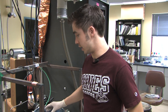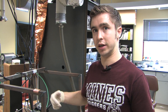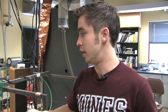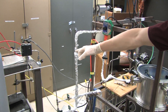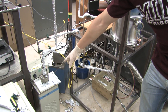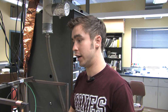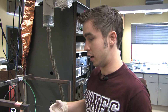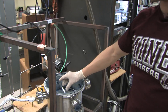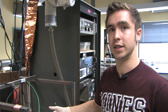To apply the second membrane on the outside — the one that attaches to the hydrogen molecules and brings the hydrogen down towards the actual tube wall — we will be pumping either molybdenum hexafluoride, from this container over here, or molybdenum hexacarbonyl, from this bubbler down here. Either precursor will react with oxygen, oxidize, and turn into molybdenum oxide, forming a deposit on the tube wall. This process occurs through plasma enhanced chemical vapor deposition.